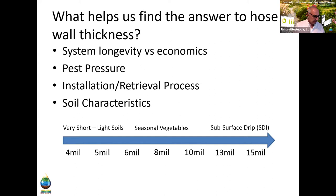That's right. I mean, normally it's more than likely just different, right? You could, in theory, have too wide of a wetted band. If you were doing a single row of plants and you were putting water all the way out to the edges of the bed, you could, in theory, do that. As a manufacturer, we try not to design things that operate in those fringes. We wouldn't put a flow rate out there so high that you could have that problem, but you can see it. Too high of a flow rate in a heavier soil could push water outside of your root profile. That can definitely happen.